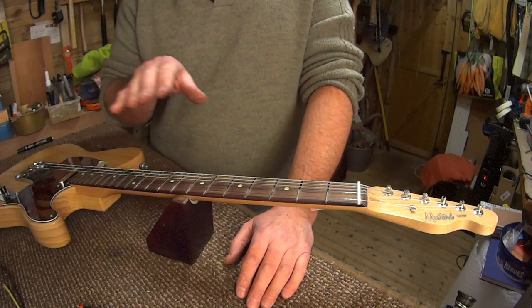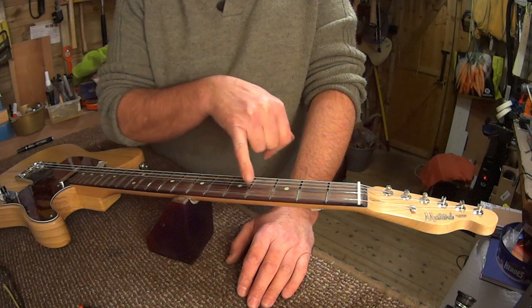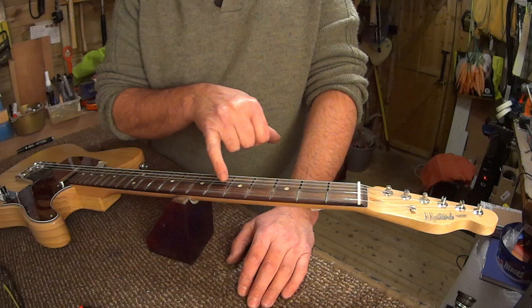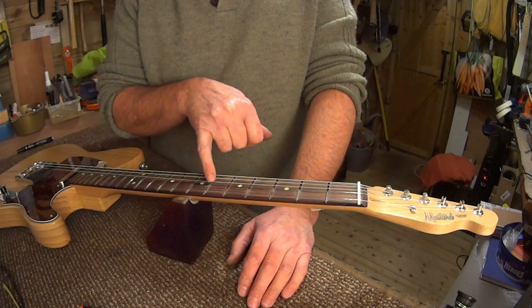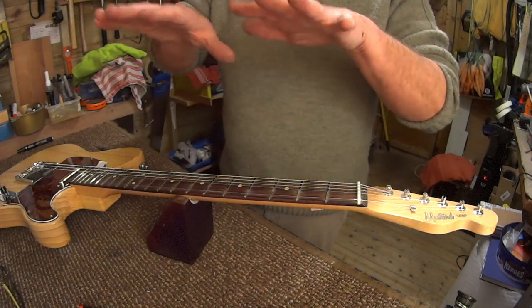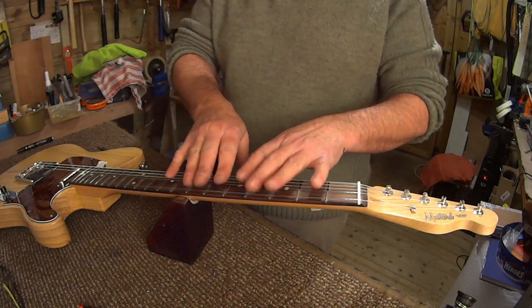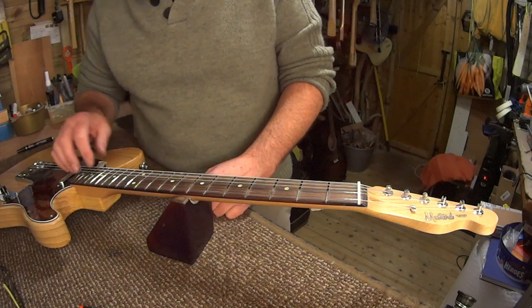And it doesn't matter that this is technically low here, because it's not touching the black pen at all. It's the only place that isn't, it's not cutting at all. These two are low and it will make that one effectively high. It's not a case in this one because it's not choking off, but if it was serious, substantial enough, you'd have to take everything down a little bit to kind of bottom out this one. And how far you go with it is definitely a judgment call.